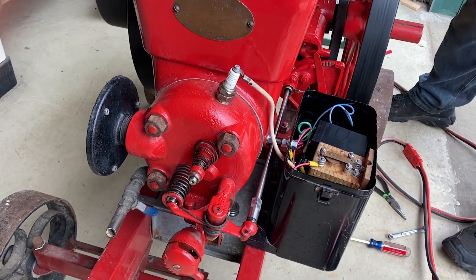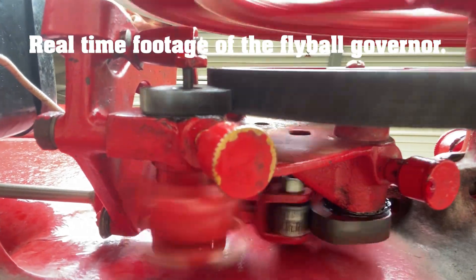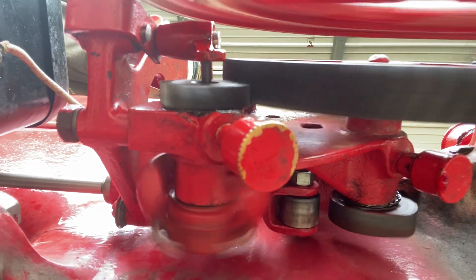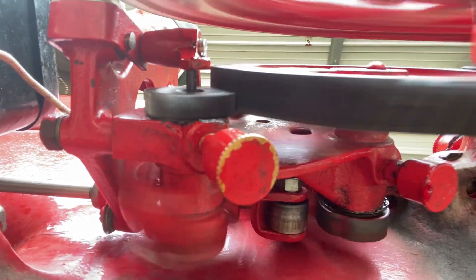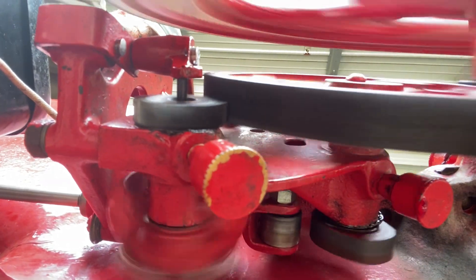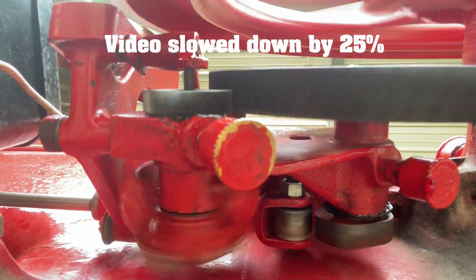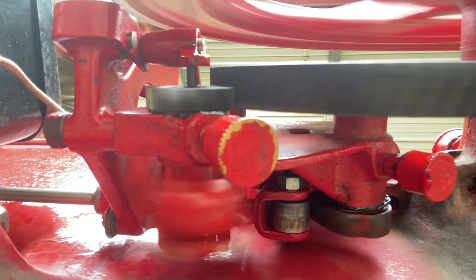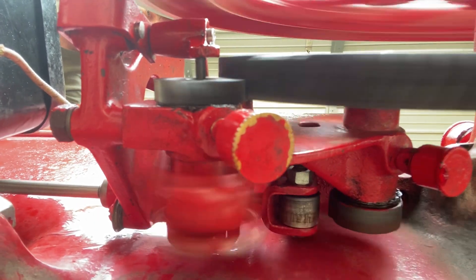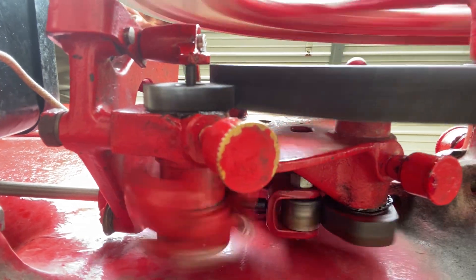The following slow motion clips clearly illustrate how the governor functions and why it is called a hit and miss engine. Videos were filmed from the bottom of the engine looking up. As the rotational speed of the fly balls increases, they spread out and draw the actuator pin in away from the blocking lever, tensioned by the spring, causing it to drop into the notch in the end of the exhaust valve operating rod, thereby allowing it to complete the ignition circuit and open the exhaust valve. The proper spring tension pulls the blocking lever out of the way as the fly balls pick up speed from the hit stroke.